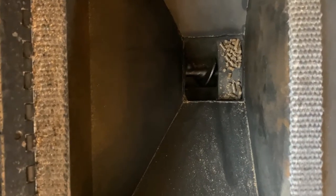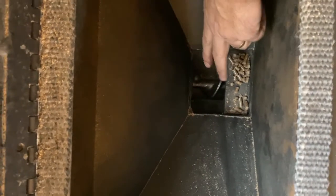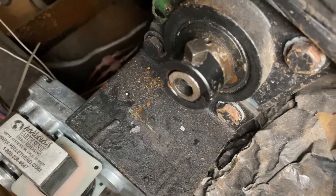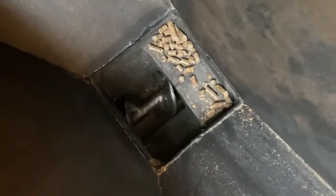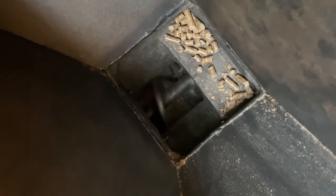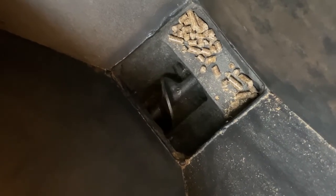I called the stove on so the lower feed auger would continue to clear out what's beyond this. I still have the motor off and I'm basically just turning it by hand now to get everything cleaned out of it, now that I got it unstuck and unjammed. I'll show you here how much faster it's turning just by doing it by hand. I just basically kept working this back and forth, pulling parts out until I got it unjammed.